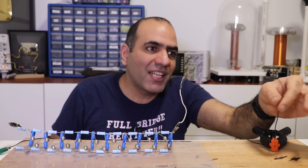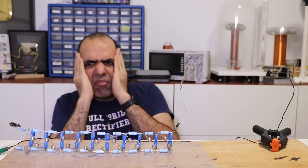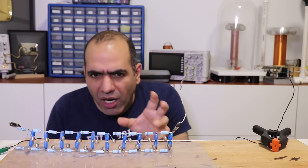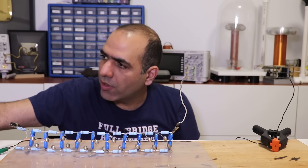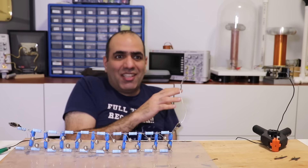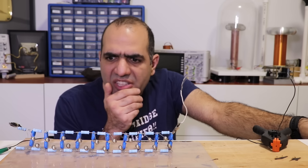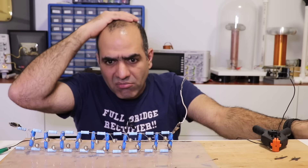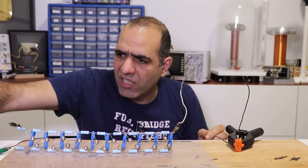This is the output of the circuit, and that's the ground, and hopefully there will be huge arcs between them when I turn on my power supply. Nothing? I can't hear the high voltage. Maybe my gaps are too wide? I can raise the power supply to give it more voltage output. The voltage was so high, the arcs instead of jumping at the output, they were jumping across the resistors. Maybe I have to make my gaps shorter so the voltage drops.